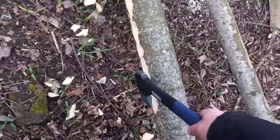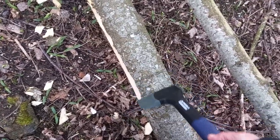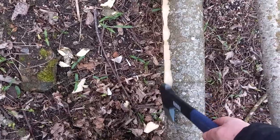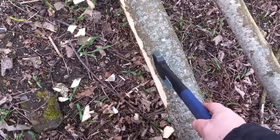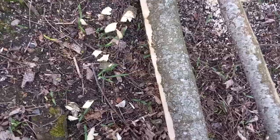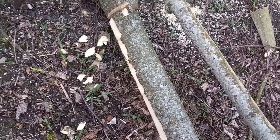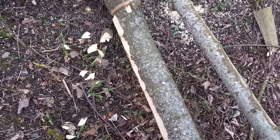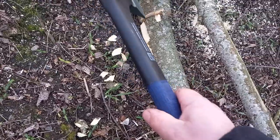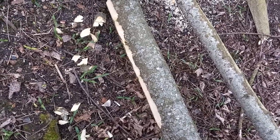So what I'm going to do is take the bark off this side and that side. This side here will be ornamental and left on, so I'm not going to take that bark off. If this gets all filthy and dirty, it doesn't matter because that much of it is going to get cut off anyway. This will accelerate the drying of the log. I know you're supposed to mature these things for years, but we're working with green wood here. Yes, it'll create tensions in the wood and we'll get cracks and splits and shakes — which are cracks running along the length of the log — but we don't need to worry about that because it'll just add a bit of rustic interest.